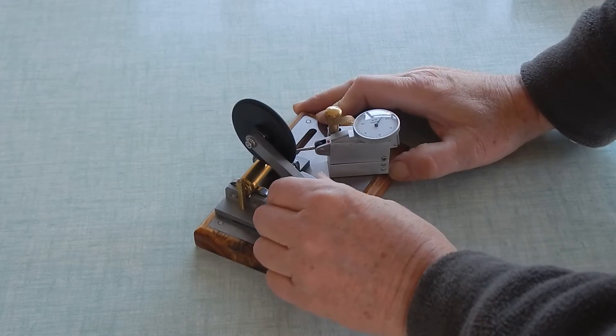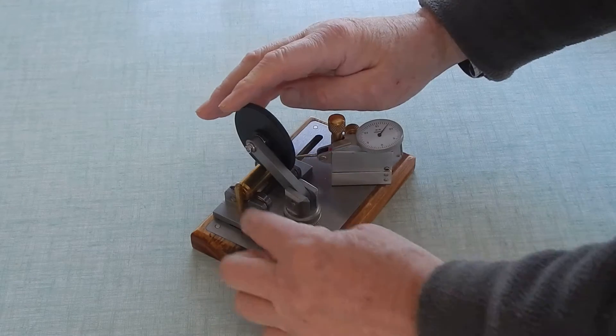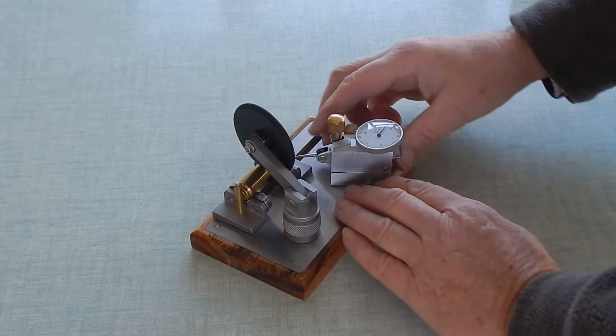And if we have the wheel at a slight angle, as we rotate it, it tends to hold the cartridge case back against the stud face, so that stays in the same place.